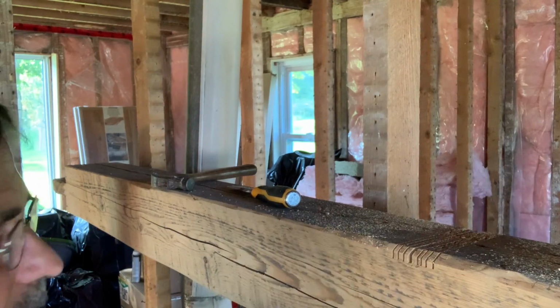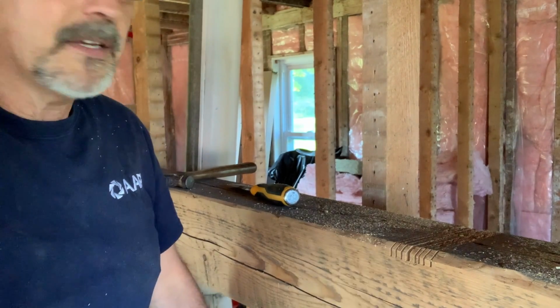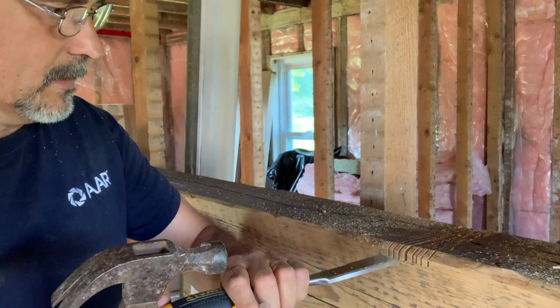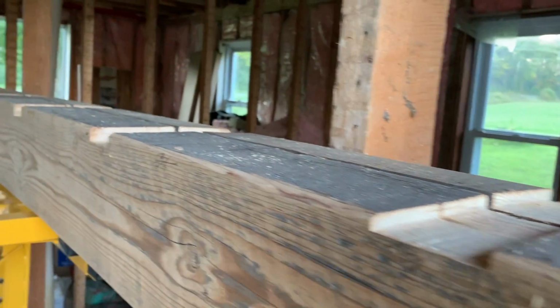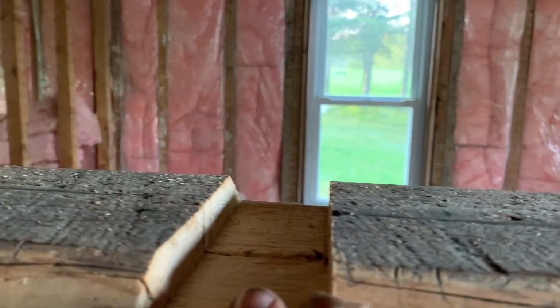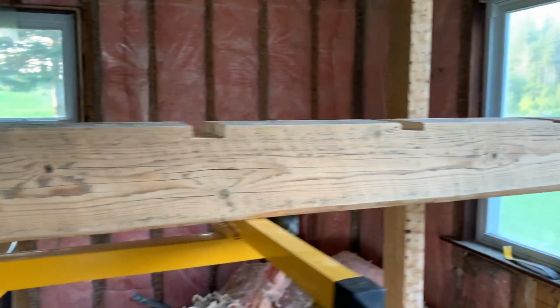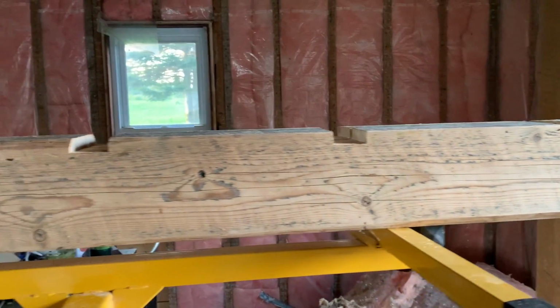Now I've done all the lines here. This one was 5/8. And I just did the lines, and now with the chisel, I gotta tell you, I feel like a boat builder, a wooden boat builder, making all these nicks and measuring and figuring out. So the idea is that each one of these is gonna receive one of those, and if you are a keen observer, you will see the curve reflected in the beam. So we start with nothing at the other end, and then it slowly gets deeper and deeper all the way to 7/8 of an inch.